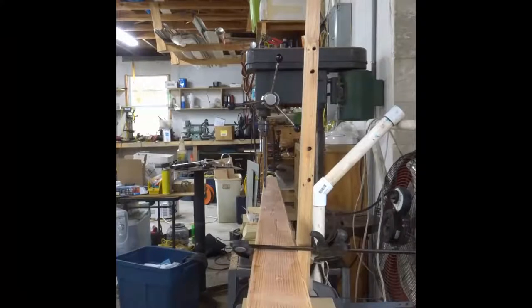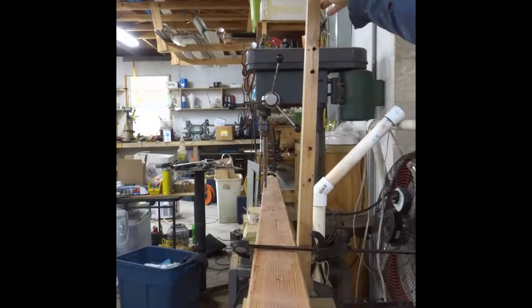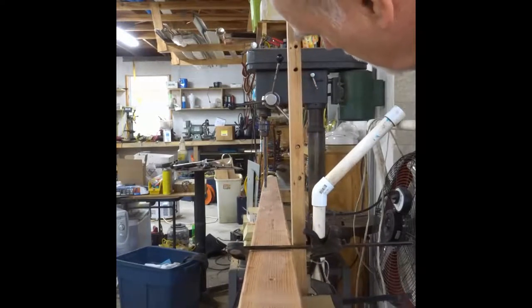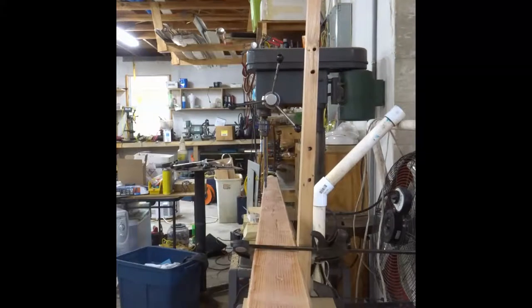This is a video clip demonstrating how we held the bottom of the bowsprit, which is the right-hand side of the bowsprit. We held it parallel with the drill bit itself so that the hole going through the bowsprit would be parallel to the ocean, basically. Each hole to be drilled was repositioned appropriately using this method.